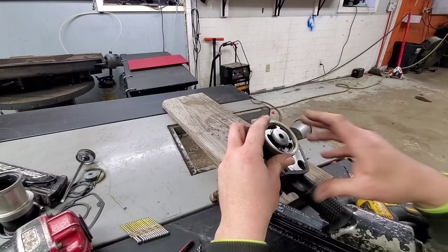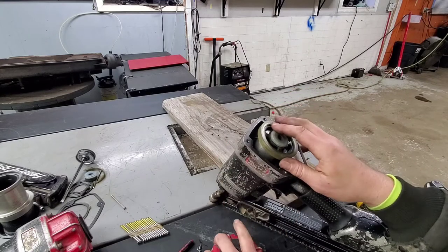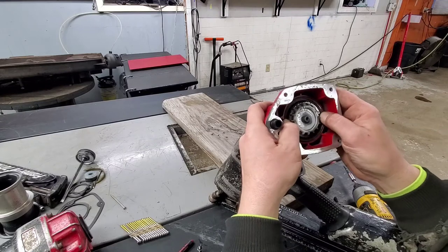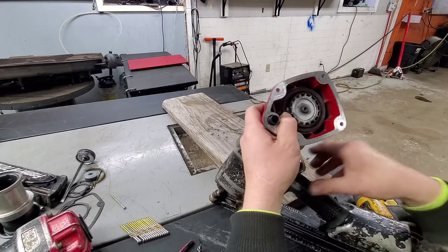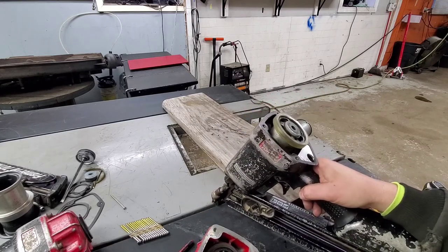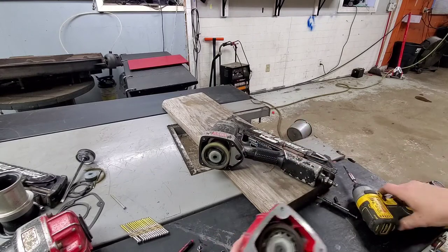They're not horrible in the top there. Our BF0212 here is in good shape on this one. Looks like it hasn't been long since it's been replaced, or it's a newer model. That seems pretty good also. But the only reason for these things to skip whatsoever is bad O-rings in an instance like this. Either the gun's not returning fully, or the O-rings aren't working properly.